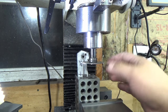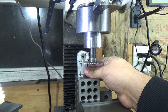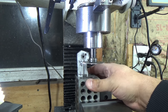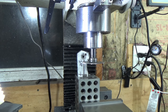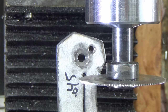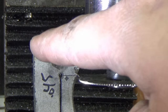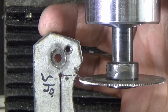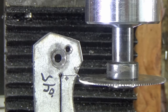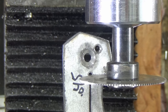We're ready to finish cutting out that lock bar. I have it mounted in my vise using one, two, three blocks to help stabilize it. You want to get this as rigid as possible — it's standing on end and the blocks are clamped in nice and tight. The alignment here is also critical, and the spacing — because the top of this handle has to clear the collet as the cut proceeds through. You want to get your lock nice and straight at 90 degrees.